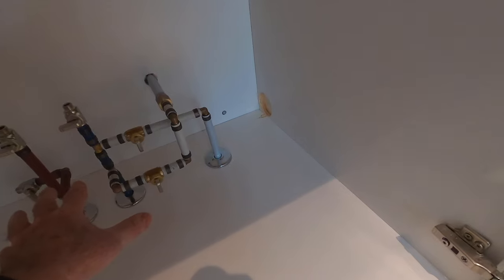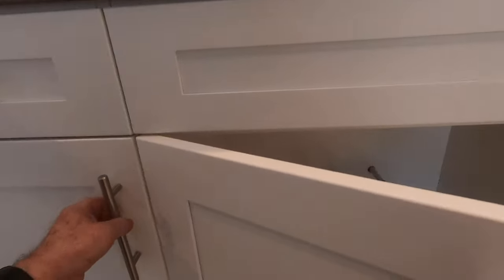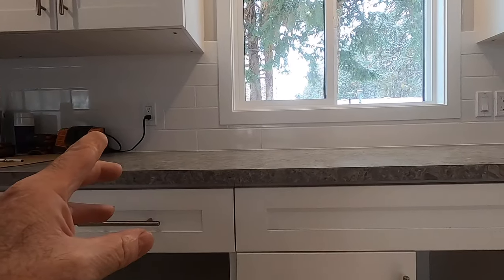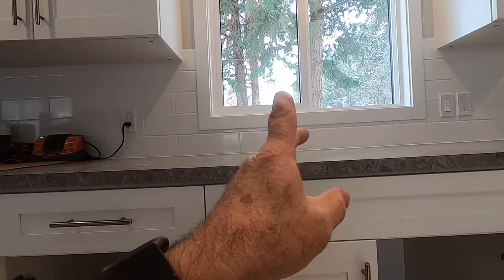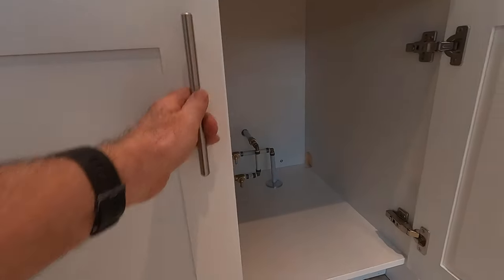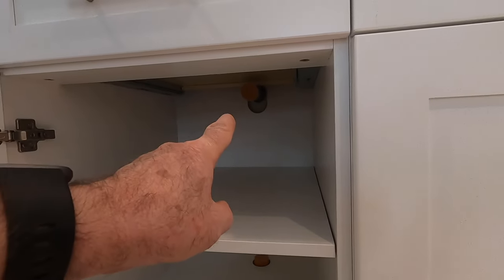Eventually when we install the dishwasher, we'll be taking everything through that hole into the dishwasher space. As far as the drain goes, you can see we have nothing there yet — all of our drain pipes are in the next cabinet to the left. The reason the drain plumbing is over there is because we have a window here, and this home has two-by-four walls, so you can't run pipes up the wall where the window is. They run up beside it, and then we have to bring the pipes through the side cabinet into the sink space. There's where the drain connects down to the sewer, and we've got a vent up there which vents the whole system.